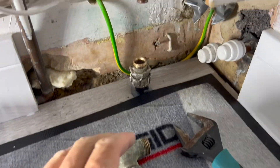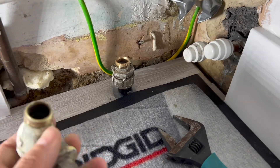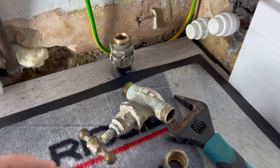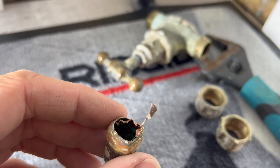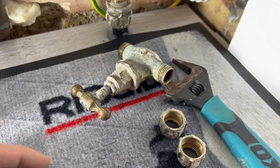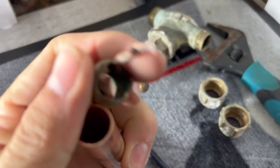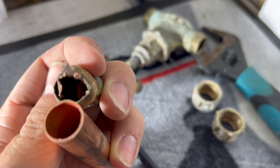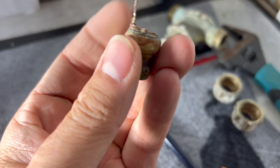The common one in one here — damp symptoms, everything wet around there. What you can sometimes find is when these get tightened up, the olives actually crush the pipework. If you just see this copper pipe — this is 70s copper — just see the difference in diameter. It's so thin, this stuff; it literally just tightens up and tweaks it.